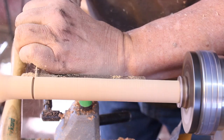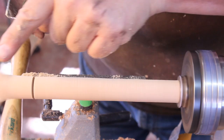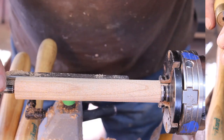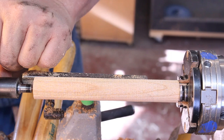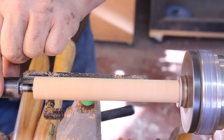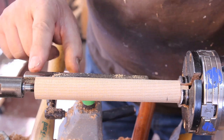I'm using a thin parting tool and at the very end I'm going to back my tail center off. I don't like to have that connection because it can get wedged in there, so I just part that off and we'll continue turning this finial. Now what I've got in here is my multi-star live center — it's very nice and ideal for finials — so I'm going to just about get that to the point. I think that's the best way to establish that center point while the lathe is spinning. Now I've got the length of my blank established and I'm going to leave my tail center up as long as I can, starting from this end going in the direction of my headstock.